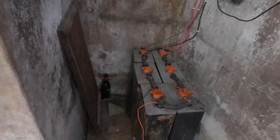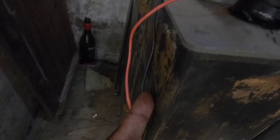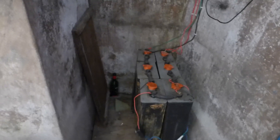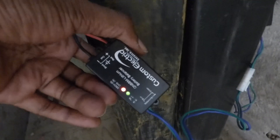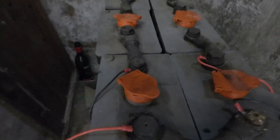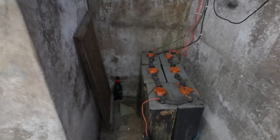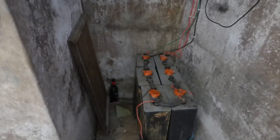What is exciting me, even though I'm not getting the results I want immediately, is that the white stuff is breaking down and the heat is beginning to travel. Initially the heat was limited to the top one-eighth of the battery; it has slowly moved further down. If this continues there's a possibility we could recover some capacity. I also put a cell balancer on — you can see it's red, which indicates it's pulling charge out of the high cell and putting it into the low one. This has been our problem battery.